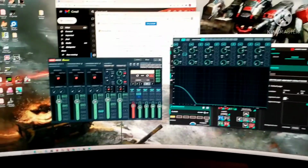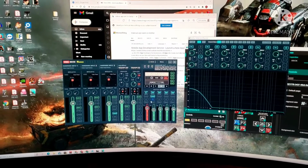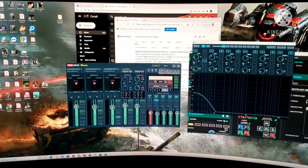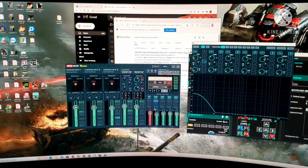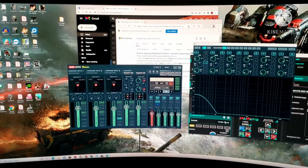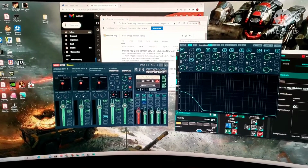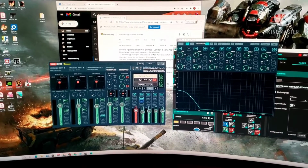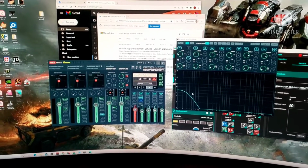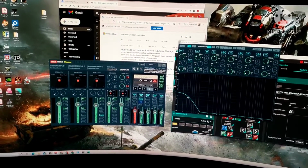And you can see here, I know, shouldn't I just be doing screen caps of my desktop if I were smarter and had more time? Yes, but I have my control that outputs the headphones on this line, and then my control that has the bass shakers is on this line. You'll notice this EQ is lit up, and you can see the EQ profile that I'm sending to my bass shakers. I've got a roll off starting in around 40 or 50 hertz here, so there's very little audible audio going to my bass shakers, and it's just that bassy shake that is happening.